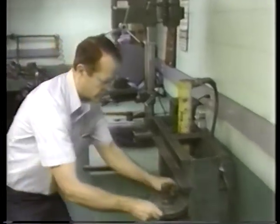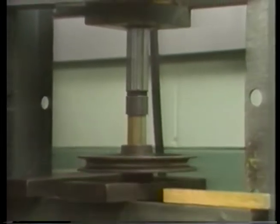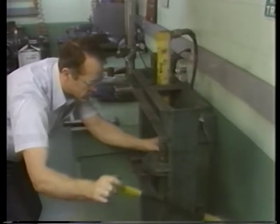Carefully line the press ram up with the bore and use a shouldered arbor or steel plate. Do not just use a block of wood, since the bearing may cut into it unevenly and go crooked, and slivers of wood can get wedged between the bearing and the bore. Whatever the arrangement, the bearing must be kept straight with the bore as it goes in.